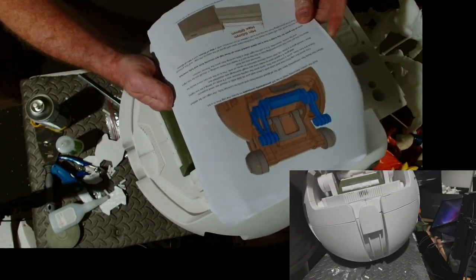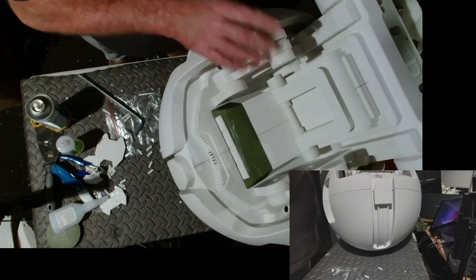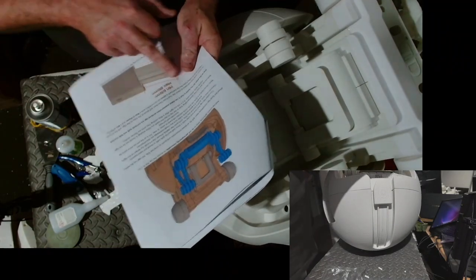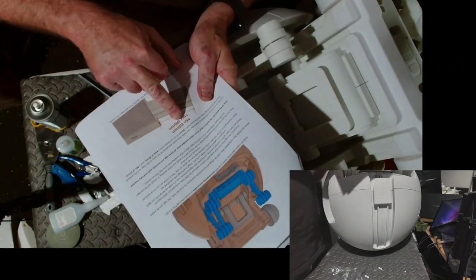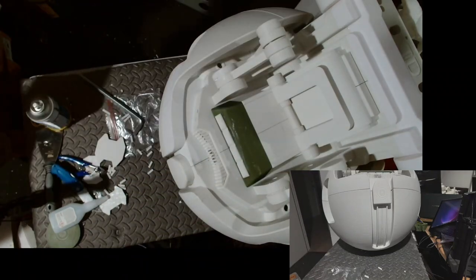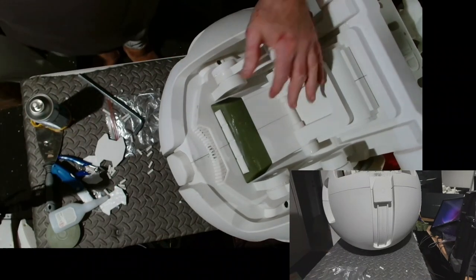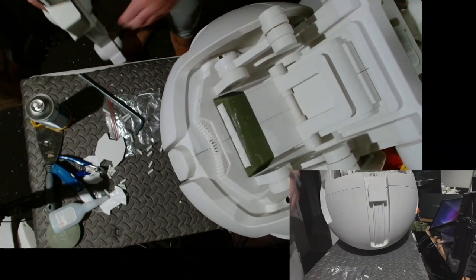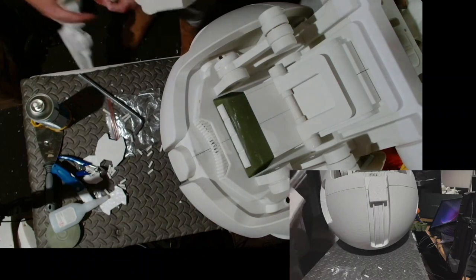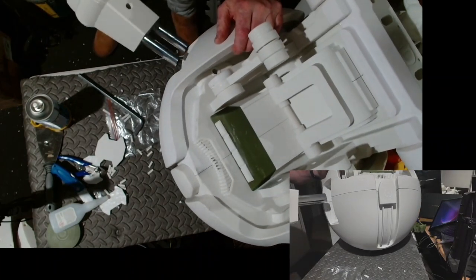Oh, now we've got to make sure. I'll just measure up. It says that the leg aluminiums can only be between 65 and 85 mil out. Cool, so mine are all okay. So this bit faces up, the bits with all the things in face up, so the legs will go in this way. Oh, there's the other go down there, okay.